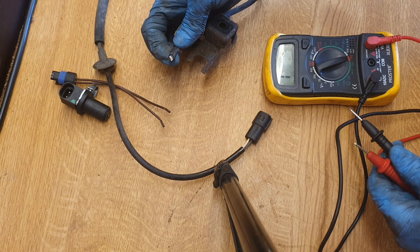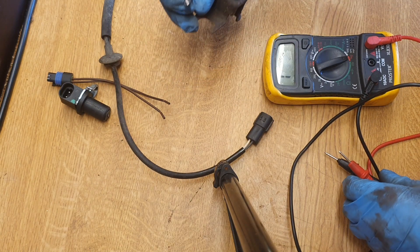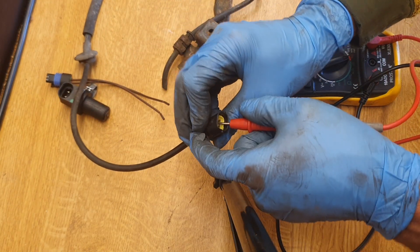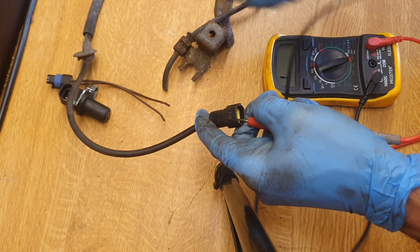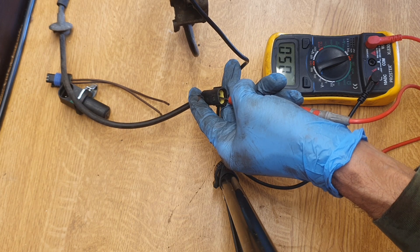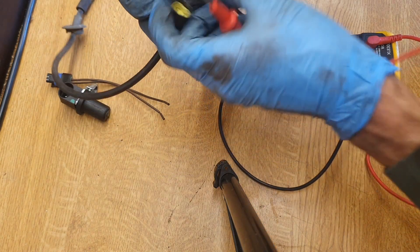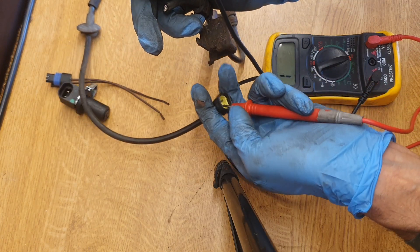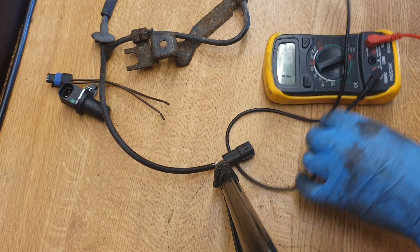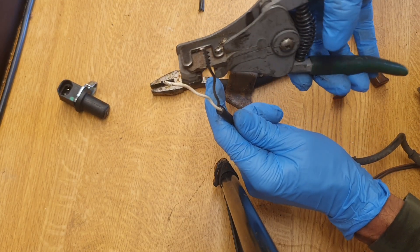What we're going to do is strip some of this wire off and then solder it onto these tails here and connect it all back together. We're going to leave as much of this wire on here as possible. I'm going to check the continuity - pick a pin here, get them on there and tap it on the end of these wires. Yeah, that wire is good. Now we do the other one - this is just awkward. So we know those wires are good, so we keep as much as possible and just solder these bits.